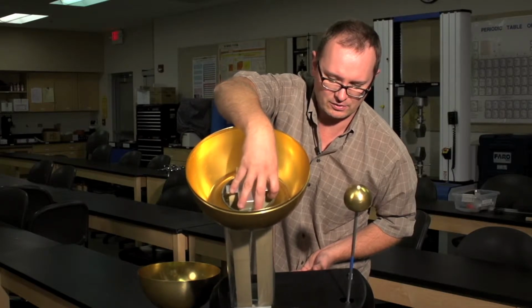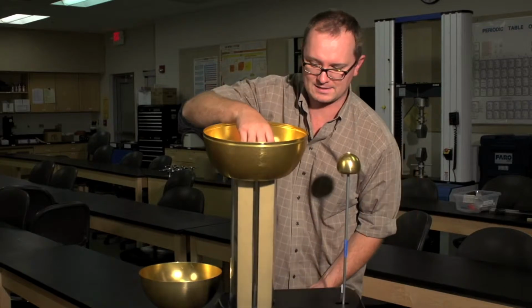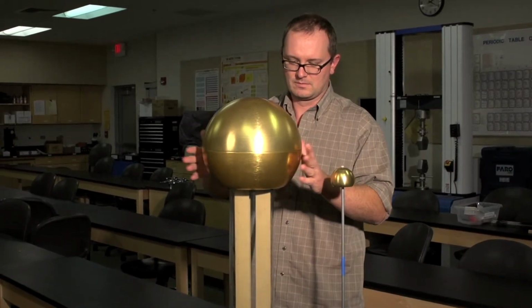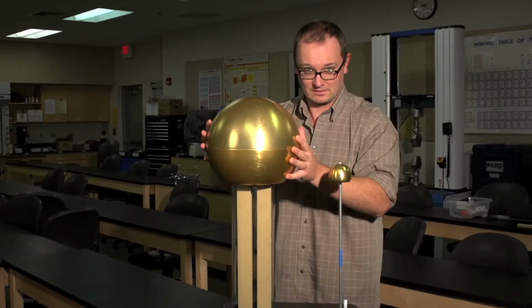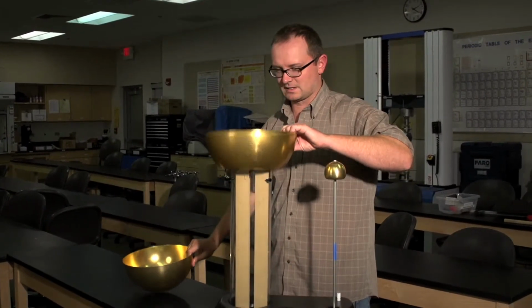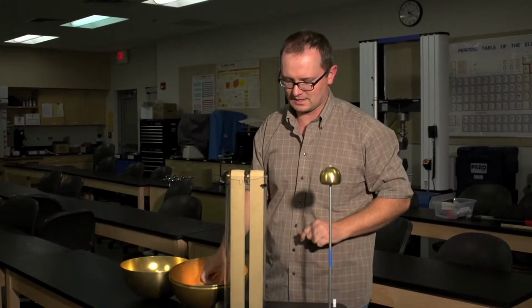Any charge that accrues on the rubber band jumps from the rubber band onto those lightning rods, and then they become attached to this entire dome because it's all conducting sphere. Like charges tend to repel, so the charges get pushed as far away as possible. They tend to accrue on the dome. Now, underneath the dome, if I take this apart, you can see there again are those lightning rods. They're very close to the rubber but not touching.